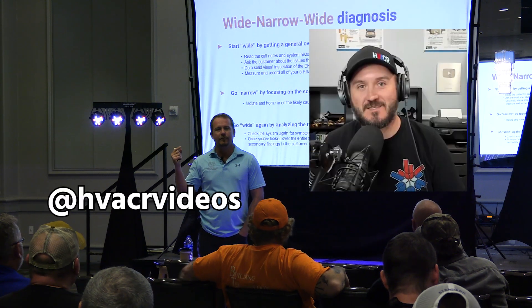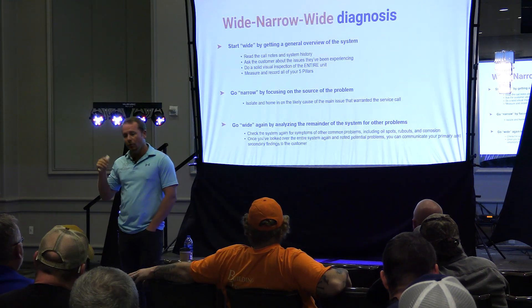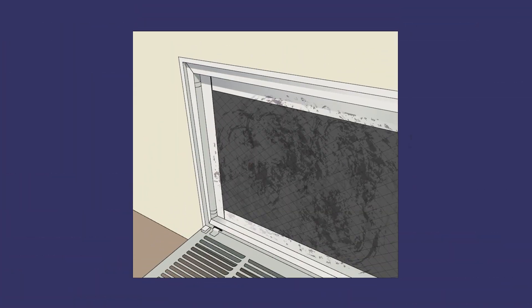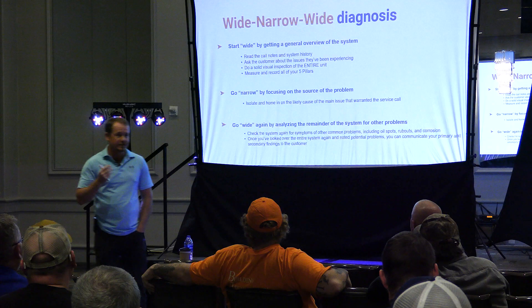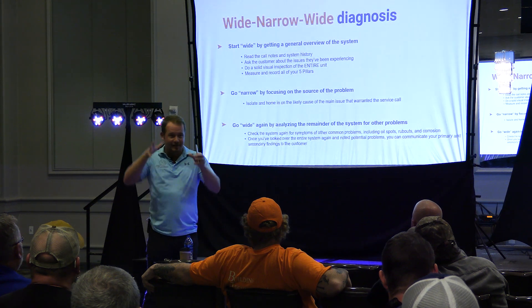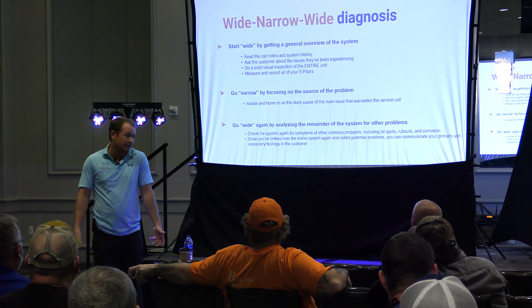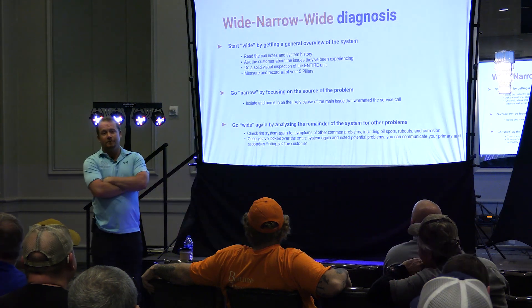Chris Stevens — I don't know if any of you follow his HVAC videos — talks about being really big picture. That's where you start. Once you've gone big picture and paid attention, check the filter, check the underside of the evaporator coil if you can get to it, look at the condenser coil condition, look for wire rub-outs, pay attention to the entire thing. Look at the install practices, venting. Pay attention to that water heater — does it look like it's been backdrafting? You might save somebody's life, or keep them from getting sick. Maybe they've been having headaches for years.